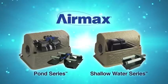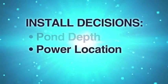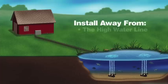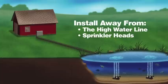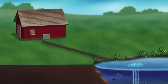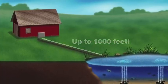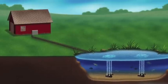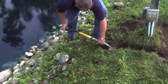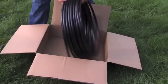Please contact Air Max or your local dealer for help selecting the correct system. The second decision is where your power source is located — near the pond's shore, or by a house, barn, or shed. Choose a location above the high water line and away from sprinkler heads. Air Max aeration systems can be placed up to 1,000 feet from the pond's shore without any loss in performance, allowing for lower installation cost without the need of a licensed electrician. If power is not available nearby, all that is needed is a shallow trench approximately 8 inches in depth and Air Max Direct Burial Airline, sold separately.